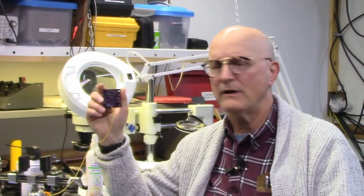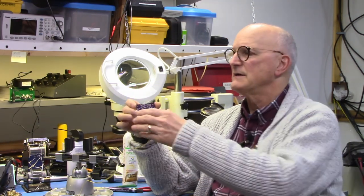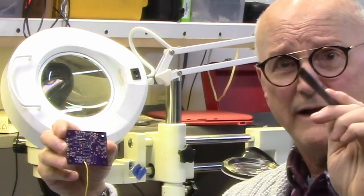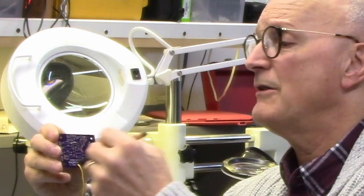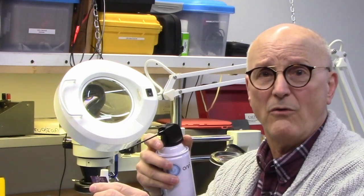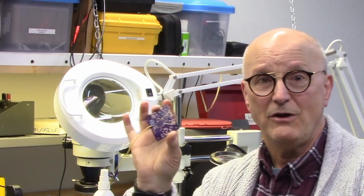You don't have to clean every connection each time you solder on a PC board — you can solder an entire board, all the parts, and then clean the whole board at once. To do this, take several layers of paper towel, put them on the bench, and set your board at an angle. Take your isopropyl alcohol and douse the board, then take your trimmed acid brush and brush the board thoroughly, adding more isopropyl alcohol as necessary to get all the flux off. Flip the board over and do the other side. Then use canned air to blow off the residual isopropyl alcohol — it blows it out from underneath the parts and dries the board at the same time. Your board is completely ready.